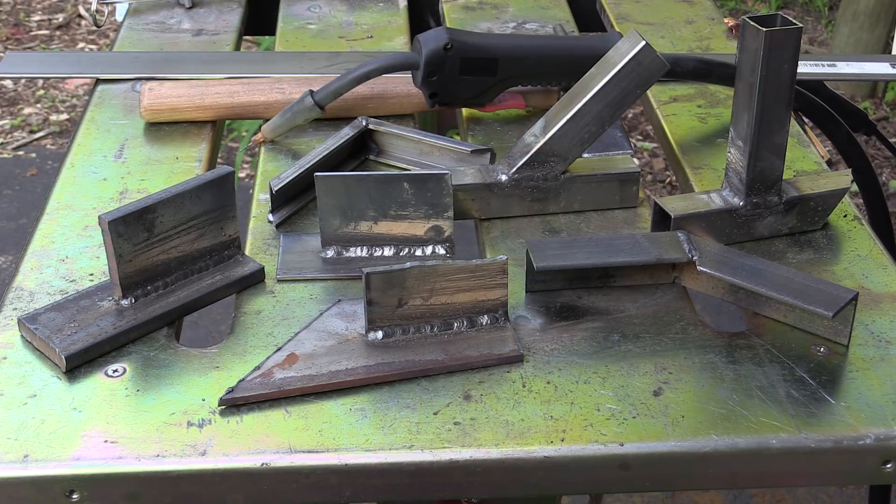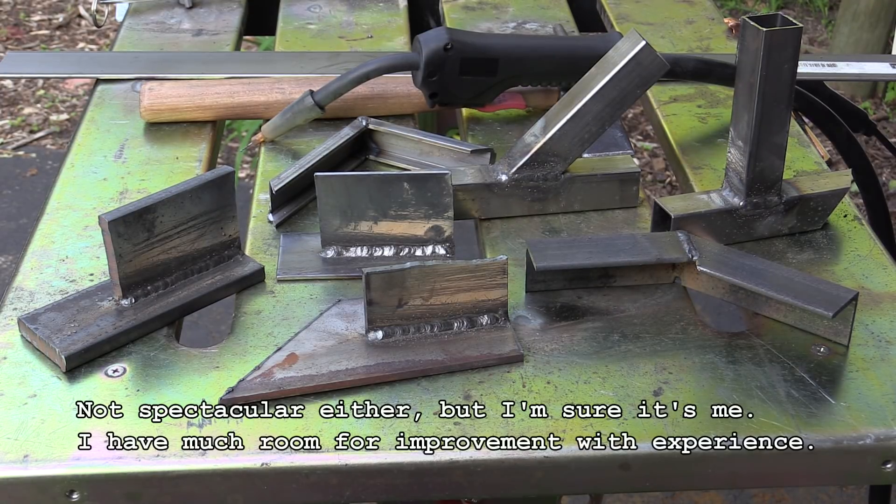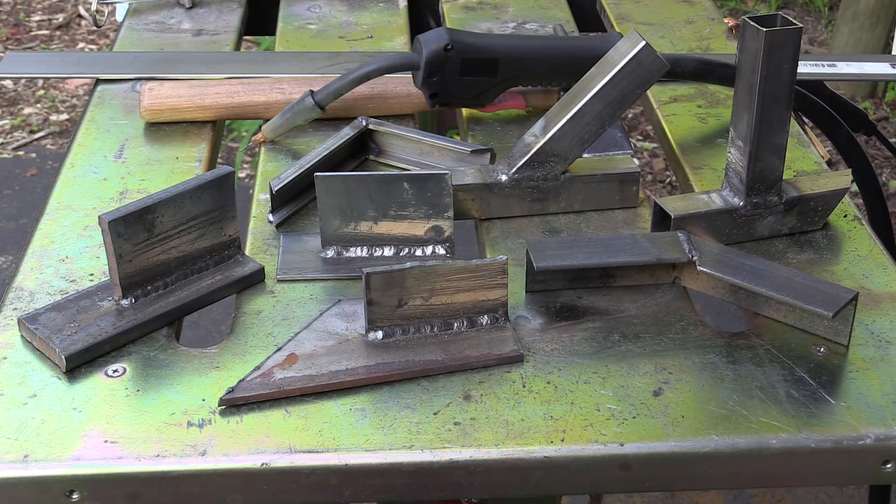So first time I've run it, and not too bad. The machine was easy to set up — got the wire in there. They pretty much limit the amount of settings and adjustments you have to do, even on the wire feed mechanism. It's all pretty much just spring-loaded to a preset tension when you put it together, and away you go. I found that it worked fine, had no issues. As a first timer just throwing together some joints, I had no problems at all.